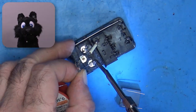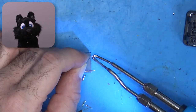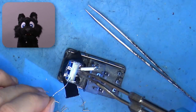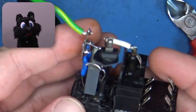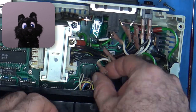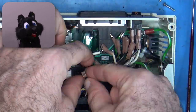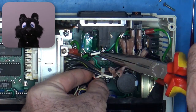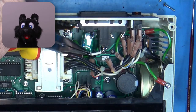I managed to cut, pry, shave, and finagle the potting compound away, snip off the old remains of the filter components, and then build a replacement with new capacitors. I did not bother about the inductors though — this isn't a switch-mode supply after all. I would be surprised if that weird combination of power socket, mains filter, voltage selector, and fuse is still available. To keep the exterior intact, I had to fix it like this.